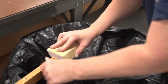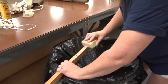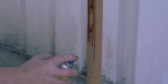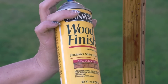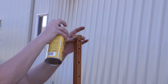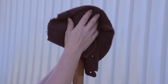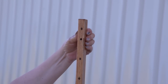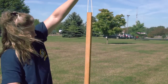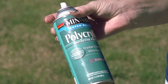After that's done we'll sand the board carefully on all sides. This is a pre-finished board but we want to be sure that the inside of the holes are finished as well. Here we're using a wood stain and following the directions on the can. Once that's done we'll take a rag and go over the board carefully. After we have it stained and the holes on the inside coated well, we're going to spray it with some varnish. You'll need two spreader boards per hammock.